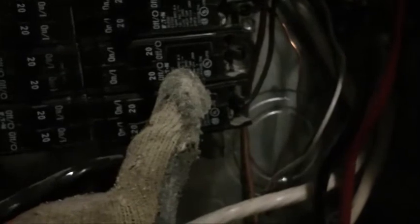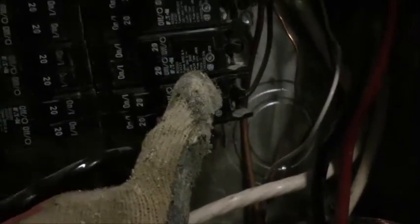Going back to the main house circuit breaker panel — I've rewired the whole house, and today I pulled off the sheet. I never secured it because I knew this day would be coming. I have some open feed here, and I'm going to do a feed for the bathroom, mount a junction box up top, and do a separate 20-amp feed. My father was an electrical inspector for years; he said in all his investigations he'd never seen a fire with 20-amp wiring, so it's impossible to overload. I use 12-2 wire throughout the house.